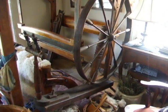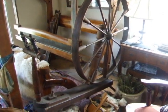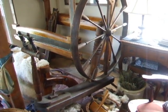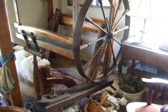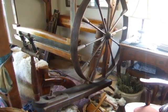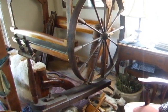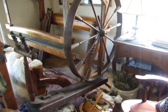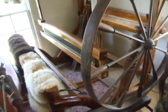I'm doing this for the antiques group, but I think a lot of sorting out needs to be done with great wheel spindle mounts, so I'll share it elsewhere. This is a great wheel — walking wheel, wool wheel, muckle wheel, big wheel — whatever you call it. It is a very large drive wheel driving a smaller spindle, achieving average ratios of 50 to 60 to 1, meaning that every turn of the big wheel results in 50 to 60 turns of the spindle. That is without an accelerator. With the accelerator, it effectively doubles, and I'm going to go into that.